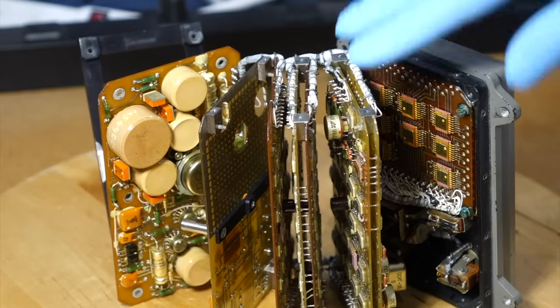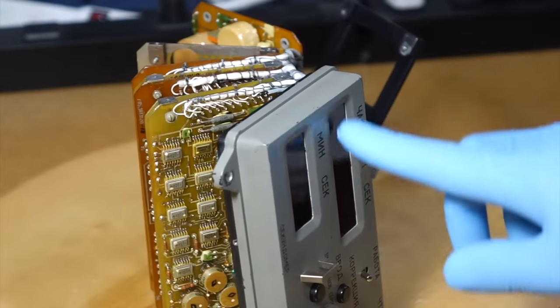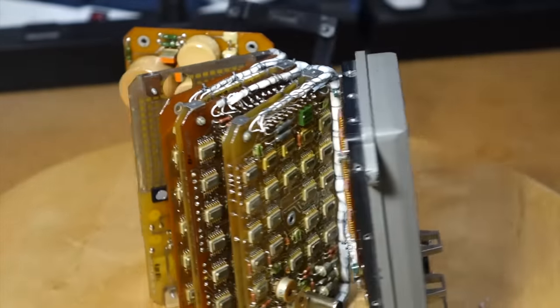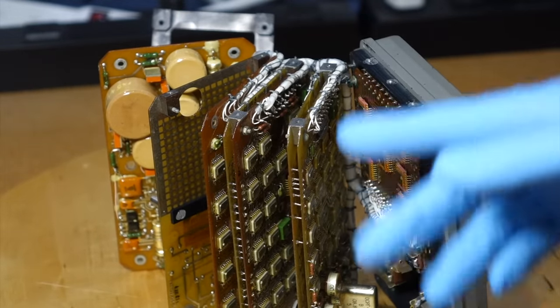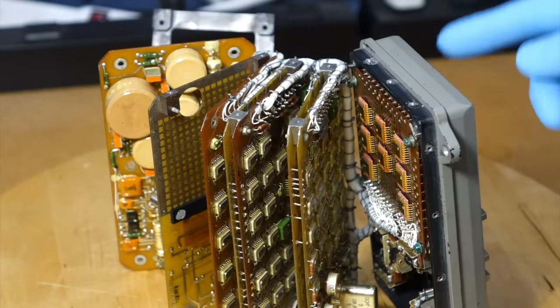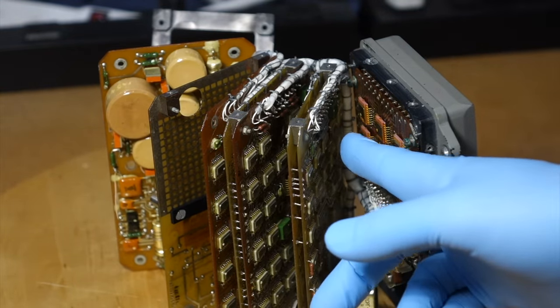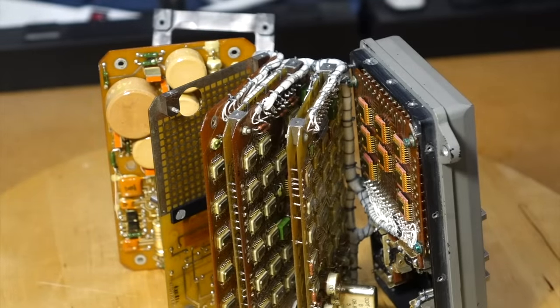So these drivers are then connected to these two boards, which provide the time on the top here, and these two boards, which provide the stopwatch on the bottom here. So those are counters mostly? It's a combination of 4-bit counter chips, simple TTL counters. You have decimal counters for decimal digits, and some binary counters as well. And then there's a bunch of NAND gates and invert circuits to reset when it hits 60, because regular counters don't reset at 60 like you need to do for seconds and minutes.